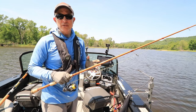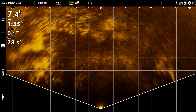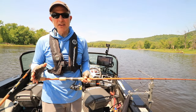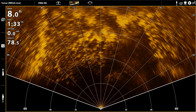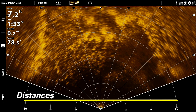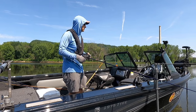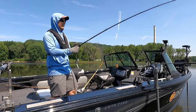The second tool is the range grid overlay, which you can display in a couple of different ways. One style is called Rectangular, where the range grid is displayed as an array of squares. The second style is called Radial, which I prefer. The radial range grid does two things: first, it measures distance from the transducer using a series of concentric semicircles; second, it accurately measures the angle from an object on the landscape view to the center of the landscape beam. If we know both the distance and direction we have to cast, we have all the information we need for pinpoint cast placement.